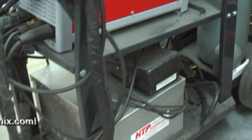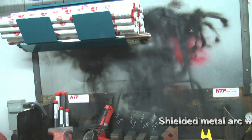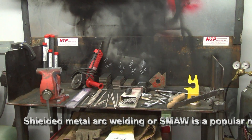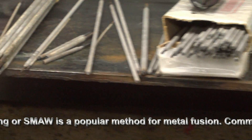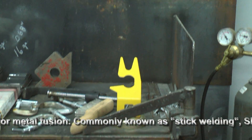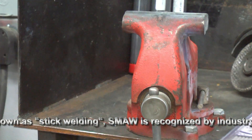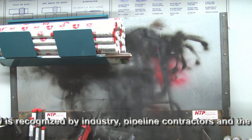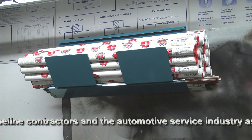Without question, you do need a safe work area. It doesn't have to be large, as long as it's safe and you've taken into consideration how to avoid flammable materials catching fire. If you don't have a welding bench, you can build one — that would be a first project with your stick welder. This bench, which I constructed, has served very well. It has a heavy steel top, three-eighths of an inch thick, that supports a lot of weight. All of the seams are tight for the backsplashes to make sure that slag and hot pieces are not falling to the floor. This workbench completely protects the wall, with a galvanized spark guard and a rack that supports the cardboard cartons of filler rod.